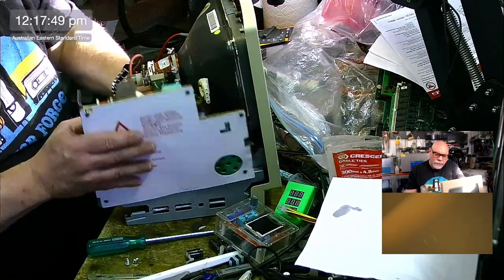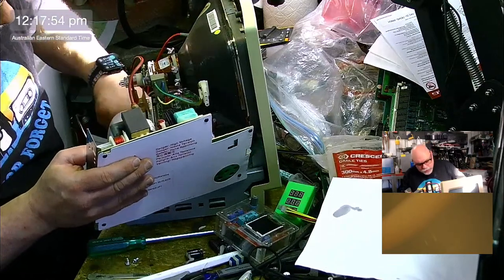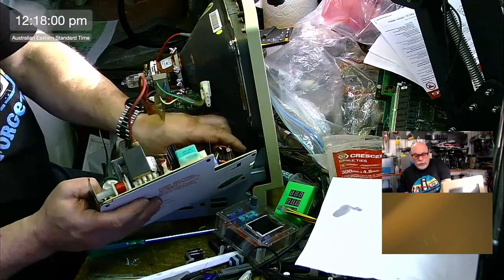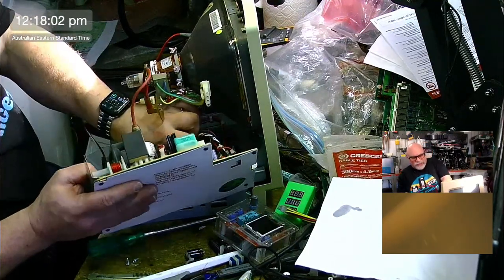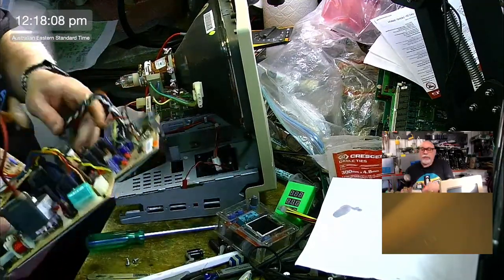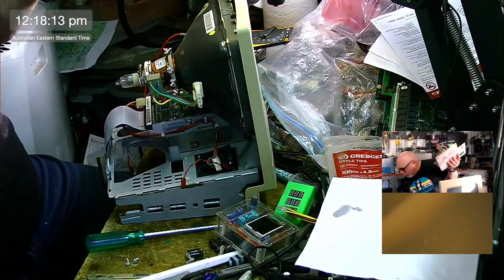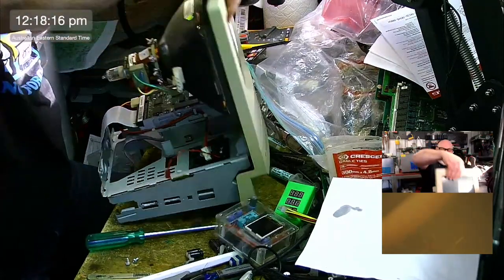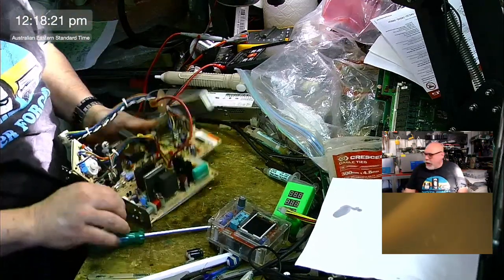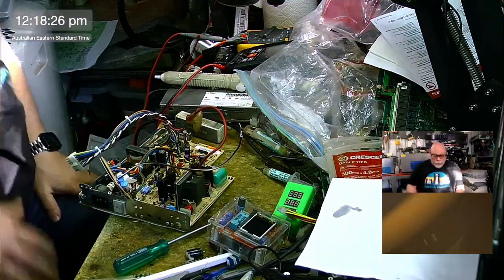And it's probably time. All right, so that's the hard drive connector, which I didn't need to undo from there because I undid it from there. Speakers are built in on these, and again, hardwired as well, so you can't actually remove them easily. If you do need to take the speaker off these, you have to drill out these rivets and remove it, which I've done many times because sometimes I need to wash these boards when they're really bad. I'll pop those there so I don't lose them. So I sometimes take the speaker off to give them a good wash.